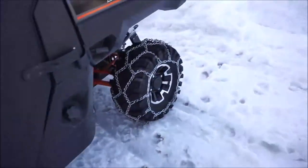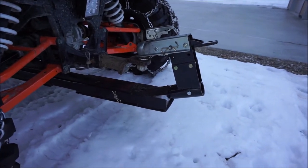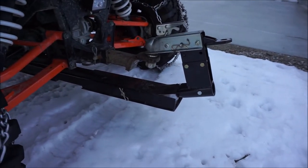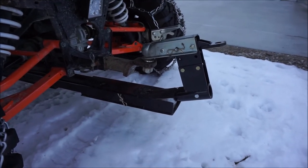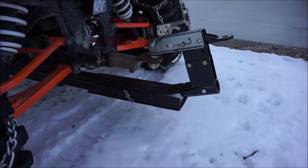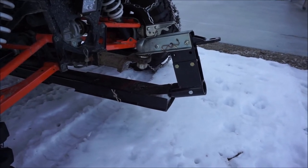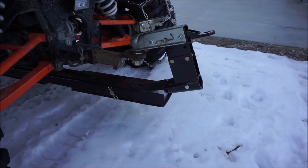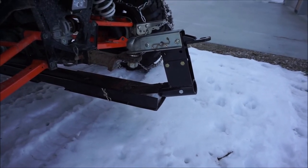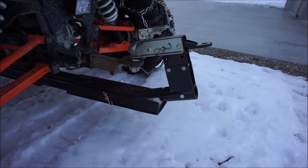The other significant weak point is on the frame — where the hitch attaches to the machine extension. This is a major weak spot and it's broken and bent right now. I've had it straightened and re-welded probably two or three times already. I'm fortunate to have a neighbor who's a welder by trade, so over the summer he'll beef it up considerably. I'm a little worried it was designed to break there rather than damage something more significant, but we'll see. That has definitely been an ongoing issue.